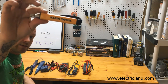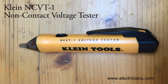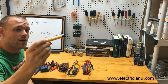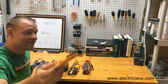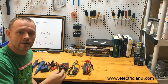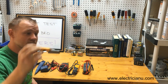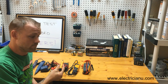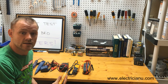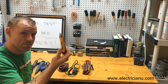The next thing I'm almost embarrassed to talk about is this — a non-contact voltage tester. I'd tell you to throw this thing away and don't ever use it, but there are some times where it is useful. The reason I talk badly about it is a lot of apprentices grab these things, stick them in something, and think they know everything that's going on with the circuit because this little light beeps. There are so many times when these things will lie to you. If you stick it into a box and it starts beeping, you have no idea if it's the ground or the neutral that has voltage on it. Even in the pamphlet these things come with, it lists a whole bunch of reasons why it may not work.